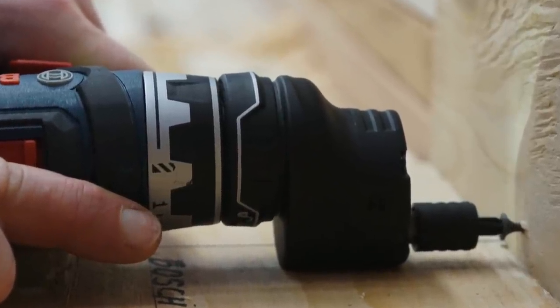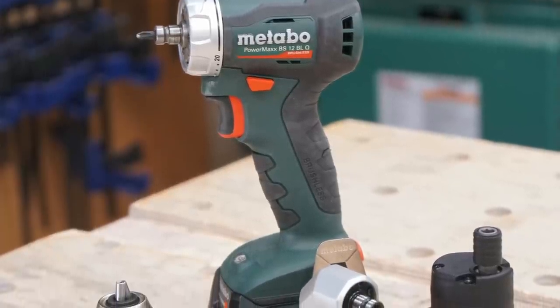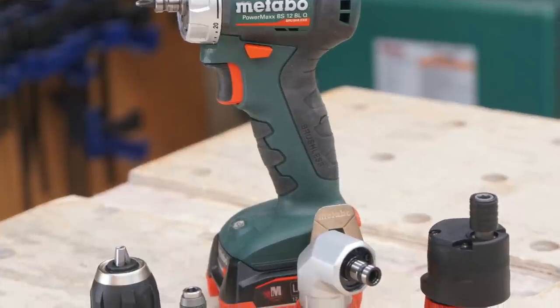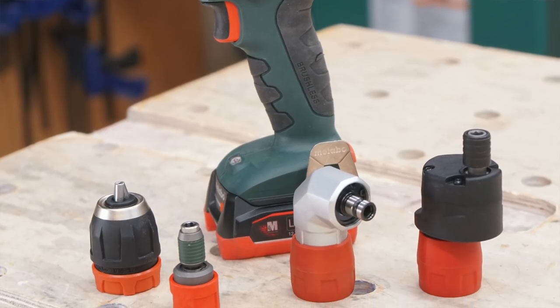The electrical, plumbing, and installation trades are going to benefit most from these tools because they provide better access and feature-rich accessories all in one tool. These are best thought of as installation drivers and are used in the finishing stages of construction and remodeling. Multi-head drill drivers use interchangeable attachments to address different installation situations — for example, a quarter-inch hex quick bit holder, a three-eighths keyless chuck, a quarter-inch hex quick-release offset holder, and a right-angle attachment. It's like four or five tools in one, and one kit can tackle a wide range of tasks without requiring multiple cordless tools.